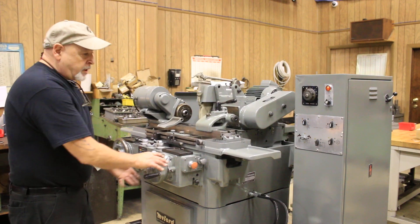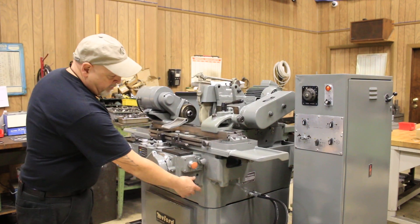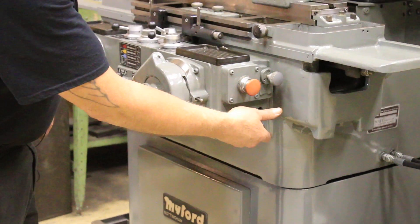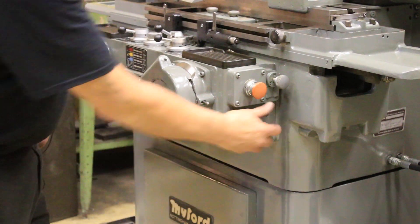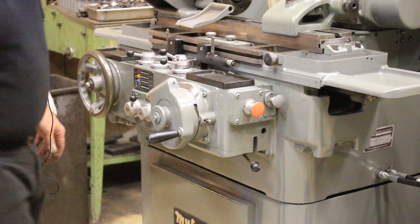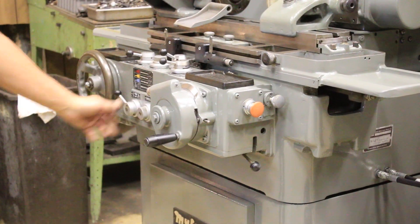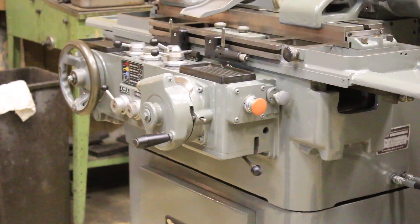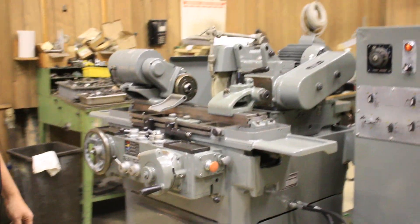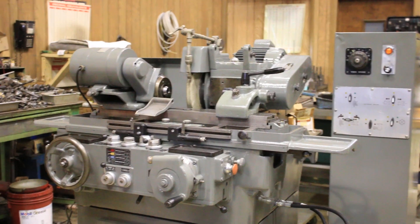You need to back up your hand wheel manually and disengage the feed. You see this little lever going up and down here — that's part of your feed. So when I go ahead and turn this on, we get the feed. There's a selector switch to say if you want to feed on the right side or the left side. It won't feed over here, but it will feed over here. In the center position, it doesn't feed at all.